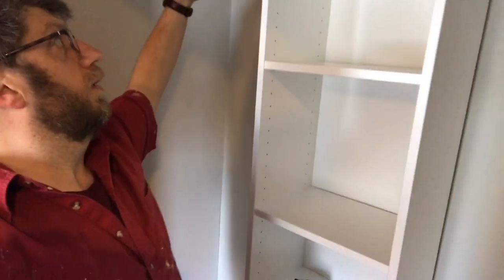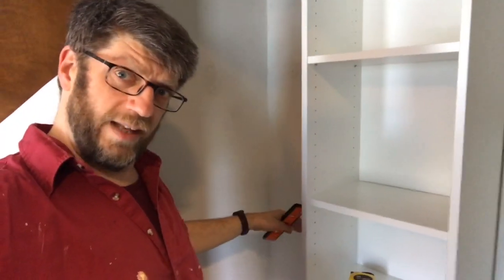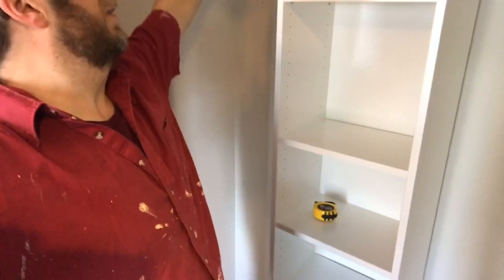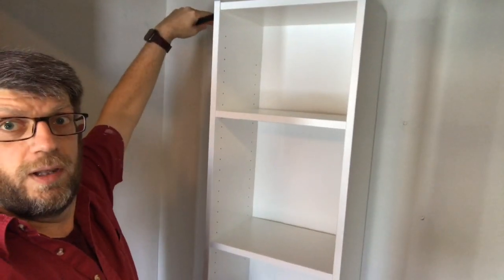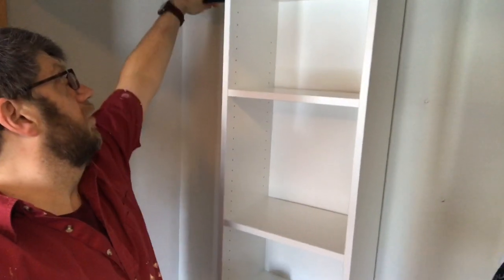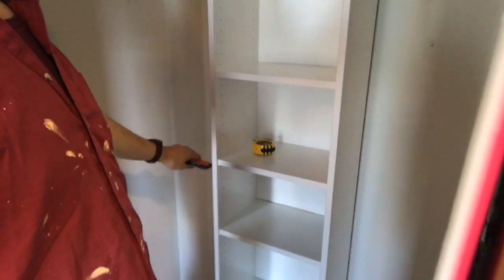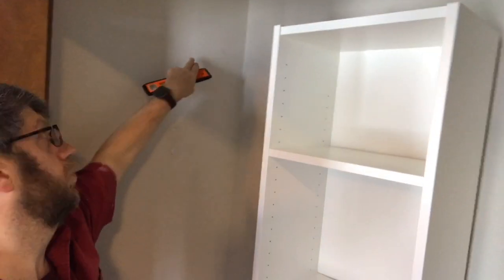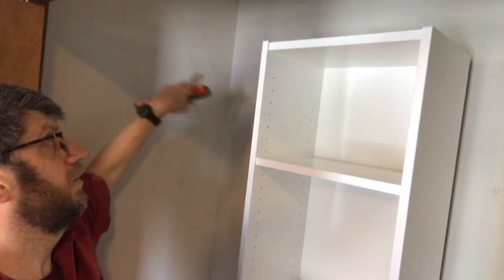My son decided to have two clothing bars - one at the top and one in the middle. To make sure clothing fits properly, you want about 39 to 40 inches off the floor for the lower bar, and about 78 to 79 inches for the upper bar - which lines up with the top of the bookcase. That's why bookcases work great here; you can fit two bars. To do this I'll need to install those 28-inch wood boards we cut and painted earlier.